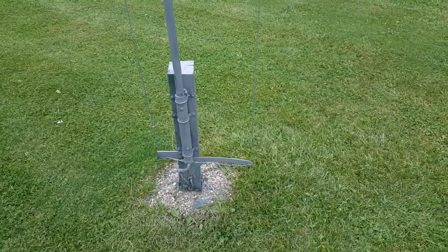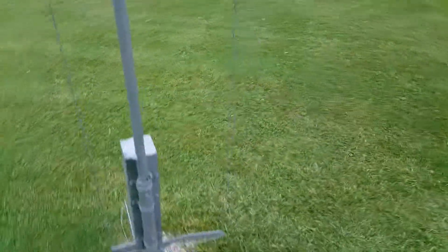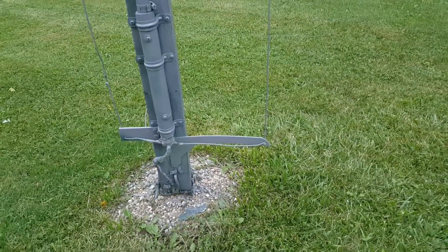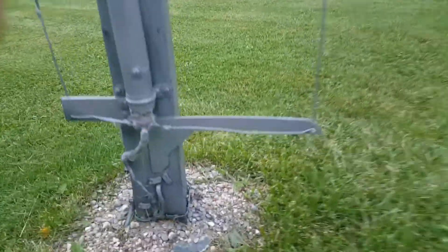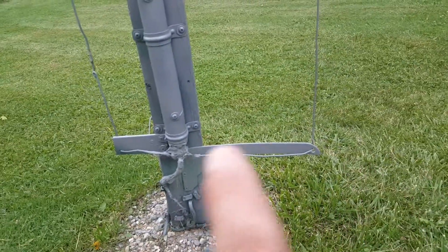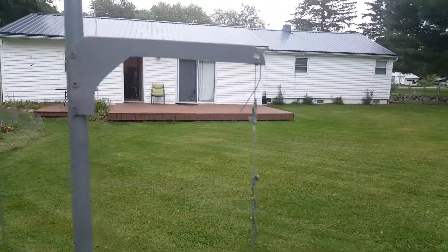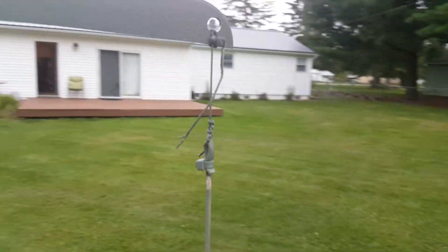The 15-meter radiator worked great, so I figured I needed 6 meters. I turned on 6 meters one night at 9:30 and made a handful of contacts with Texas — I couldn't believe it. So I added another piece of scrap plastic, this one spaced out a little farther — no real reason, just winging it. That's my 6-meter radiator, just tied off with some string.